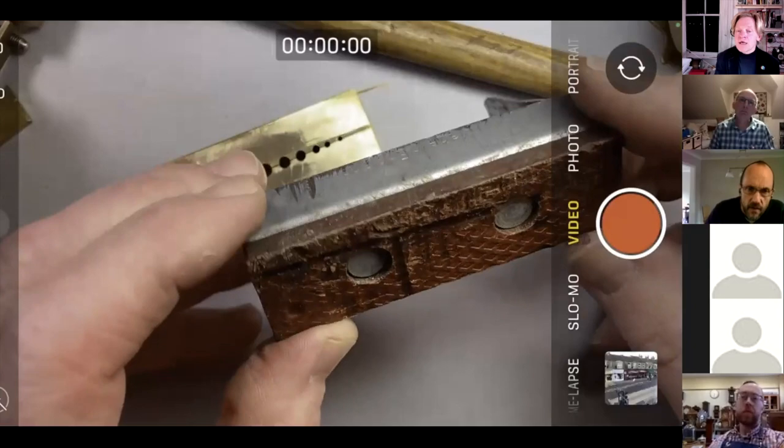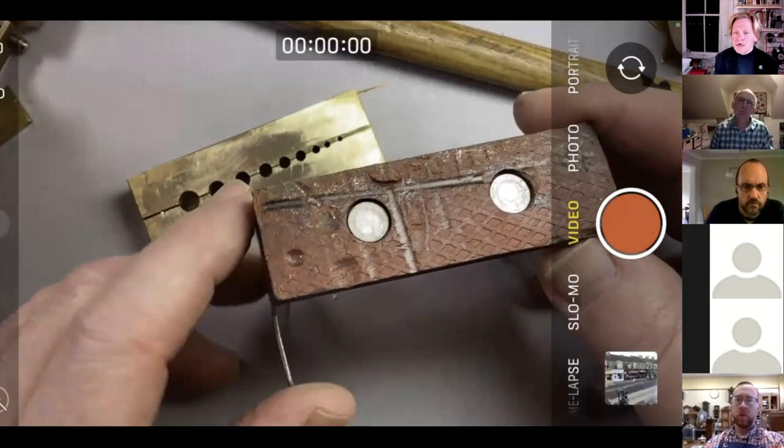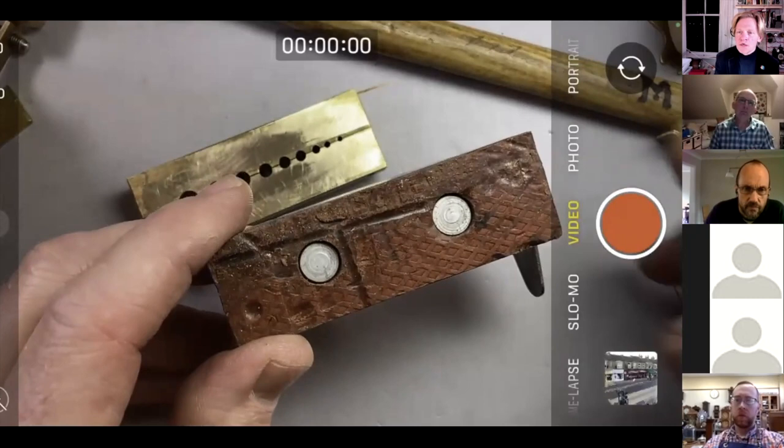fiber-based jaw things, vice protectors. I don't use metal, brass, or aluminium there because they tend to get other metals in them, which then mark the work. These things are a consumable. They last 2 or 3 years and then they get mangled up and you chuck them away.